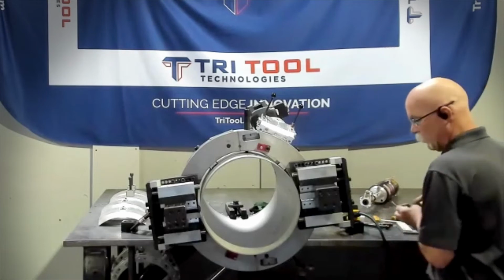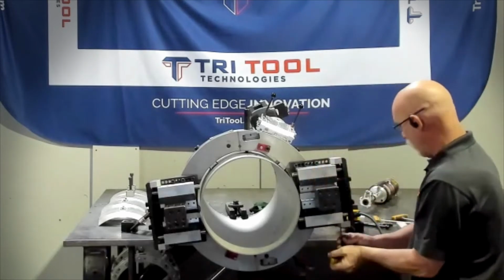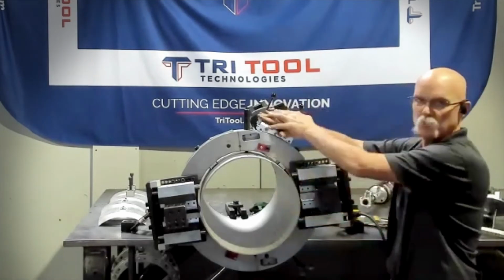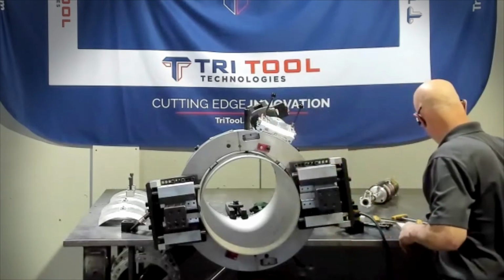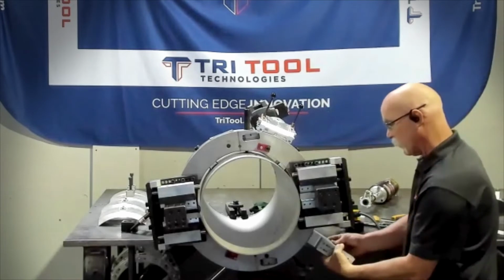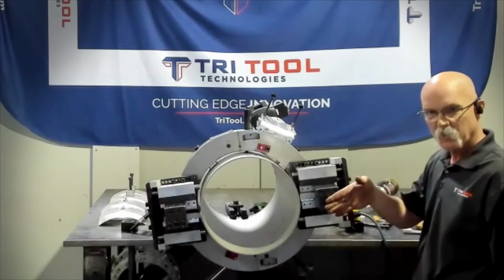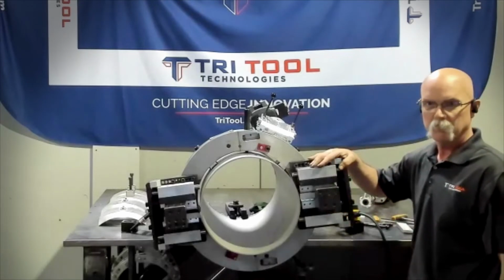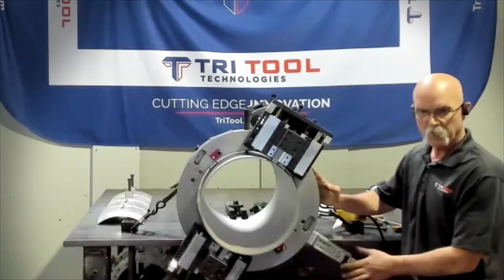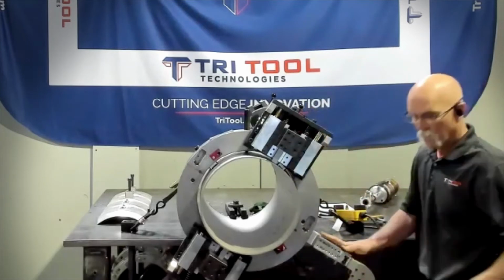The last thing we have to do is go ahead and put on our trigger pin. Now on this particular machine for this size, a 14-inch, there are two locations because we're not using standard trippers. We're going to be using an OD tracking module tripper, and they go on locations on the outside of the machine, and that's what hits that star wheel and advances it in. So we went ahead and got our tripper bolted on here on the outside for just the OD trackers.